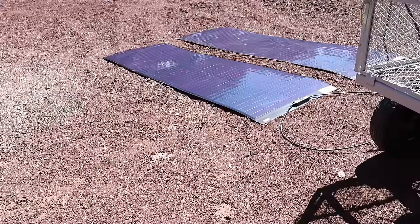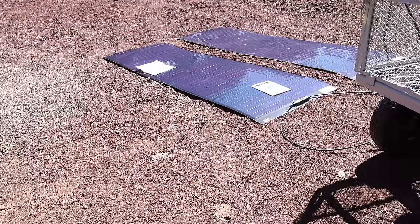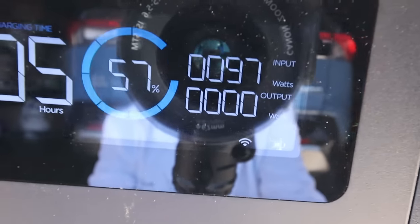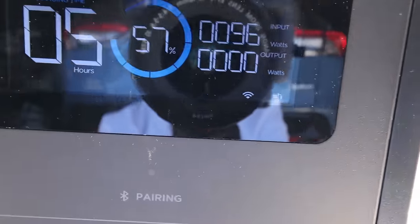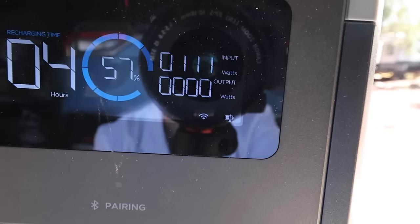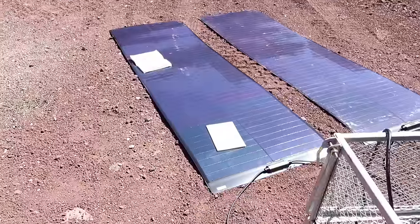Now we're getting 161 watts on the damaged panel and 165 watts on the good panel — again, about a 5-watt difference. Because the Bouge RV CIGS panel has 48 bypass diodes, it is very shade tolerant. I brought some objects out to throw on there. With a random amount of shade applied, it changes the output to 112 watts instead of 165 watts. So it's very shade tolerant — you're still getting a lot of output.